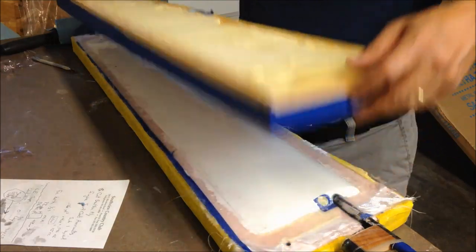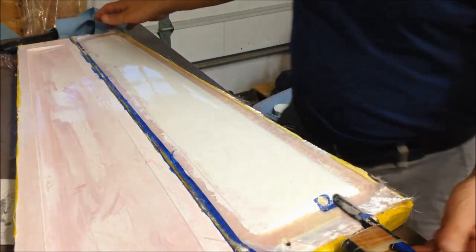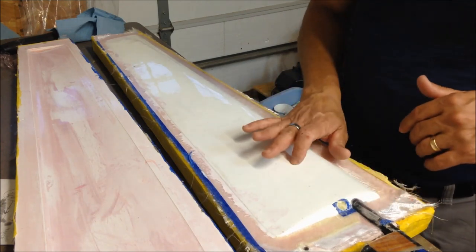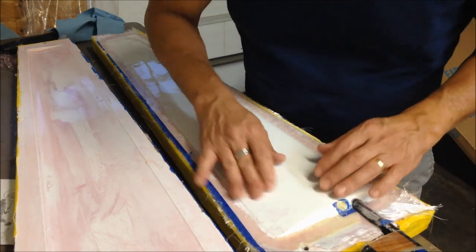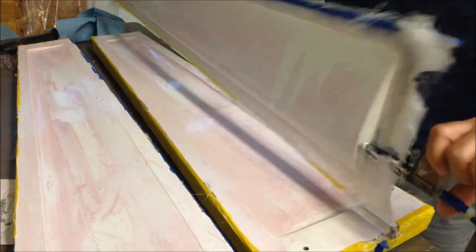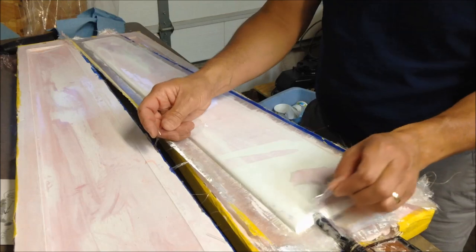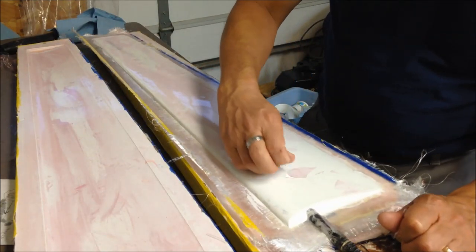So here's what it looks like inside. It's got a pinkish hue to it — that's from the PVA, which is a release compound that allows the part to release from the mold; otherwise the fiberglass part would stick to the fiberglass mold. That PVA leaves a thin film which is water-soluble but also sometimes just peels right off the part. You can see I've already started peeling some of it away — it just comes off in sheets. I've got it on pretty heavy so it's a strong film that can sometimes come off in layers.